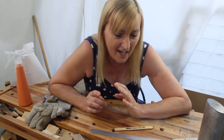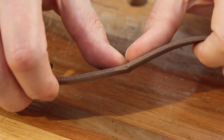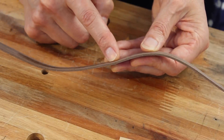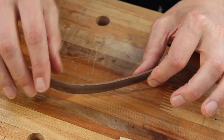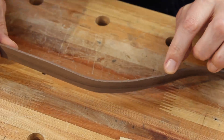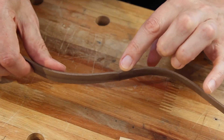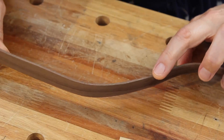The following day I felt a little bit better when I saw the break — I'll show it now. Here's the piece, and the break is just here. The thing you'll notice is it's not at the peak of the curve; it's in the middle where there is no curve, where one curve becomes the next. I think the problem was I had the piece on the iron with my hands way too far apart and was bending like this — and this piece back here would have been cold. Where it's hot it will bend and get floppy, and you can work your way into the bend. But back here it was cold and brittle, and I suspect I was pulling like this, making it a weak spot, and it broke.